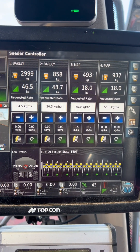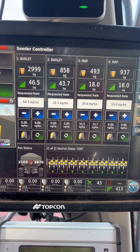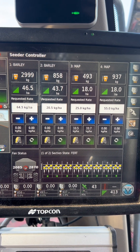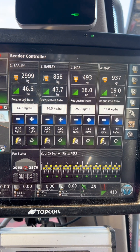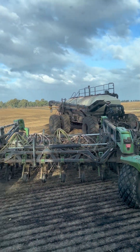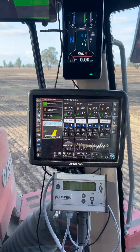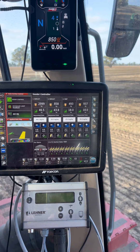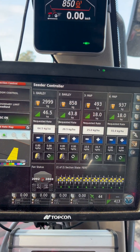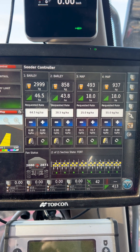If it's above the 10% change, it will tell you to inspect the rollers and recalibrate. You don't have to recalibrate — you can inspect the rollers if you need to, if you think that may be your issue. With these carts, they are a little bit prone to getting urea and DAP gunked up in the bottom of them. It pays to open them up once every week and clean them out if you're working over fairly wet ground or after some rain.